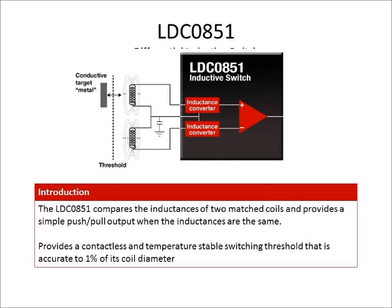Luke also wants to talk about how we implement and adjust this. As Tarek mentioned, we use an inductive sensing approach with an LDC oscillator, driving an AC current into a PCB coil. This generates an AC magnetic field sensitive to the proximity of conductive objects. As those objects approach the sensor, it reduces the equivalent inductance seen by the device. With the two-coil approach, you make a simple high-and-low comparison between the coils and provide a simple output on the push-pull output pin. There are no registers, no startup time, no programming required, and the output is just a simple high and low. You can put this into systems requiring close proximity to metal — door open/close applications and other situations where metal is moving — using the LDC with two sensor coils to sense that movement.